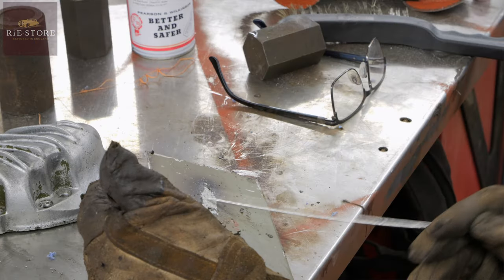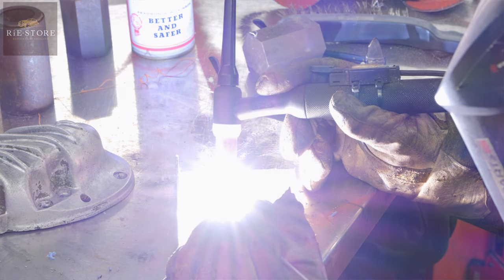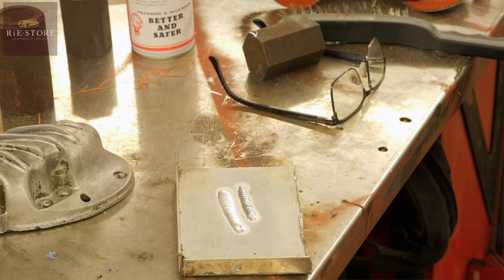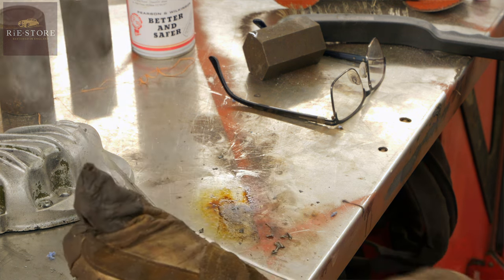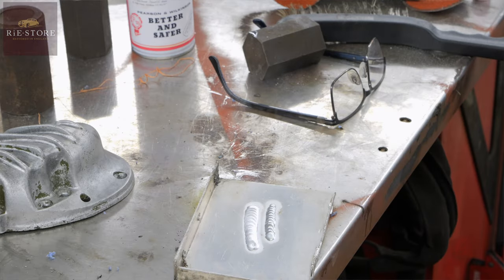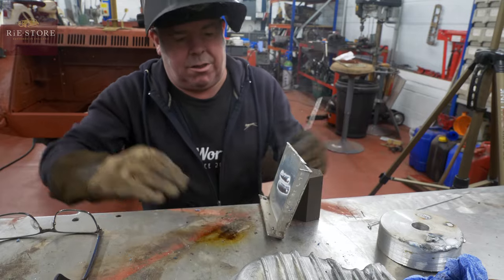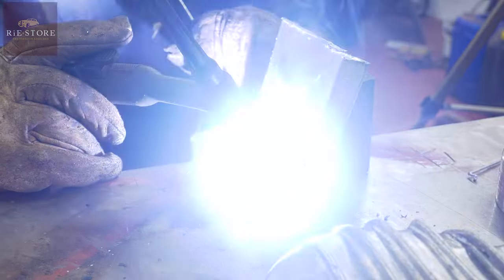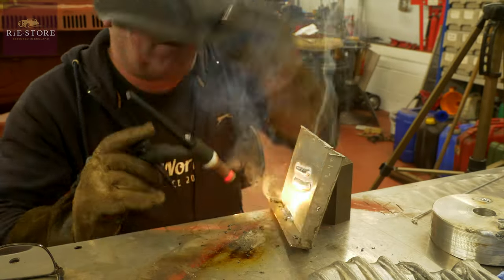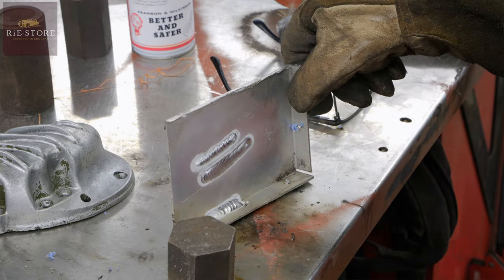So you'd have to go in hotter and you want to see that weld coming through the other side. Let's see if we can get one a bit hotter. It's quite thick — it's two mil thick — so you will get it to come through eventually, you've just got to keep heating it up. Get it hot, get it hot, get it hot. You can do what's called a fillet weld — so if you want to join two pieces that weren't welded. So that's what you call a fillet weld. It's just practice, practice, practice with ally welding if you want it to look neat.